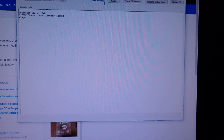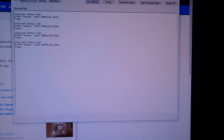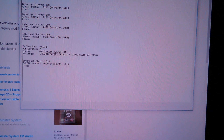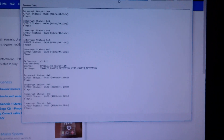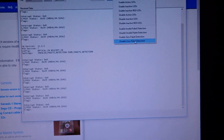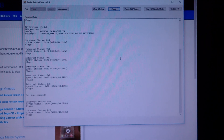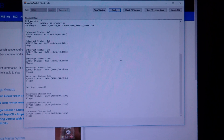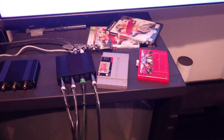The way we change our configuration is by hooking the switch up to our computer by USB and using some software the switch creator made. If you hit check firmware version, you can see which detections you have enabled — I've got invalid packets detection and zero packets detection, which is the silence. Then you can go up to config and say disable zero packet detection. That will make silence a non-factor, and that makes me much happier. Now we'll run through our test cases again, but with silence detection disabled.